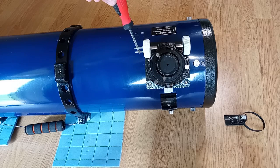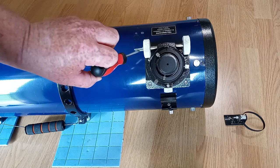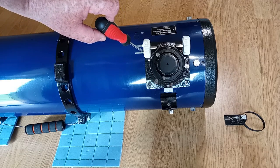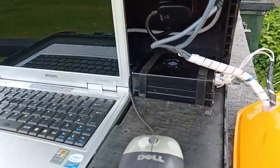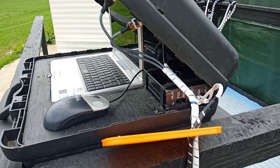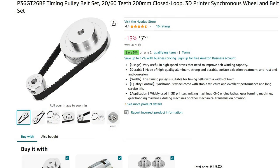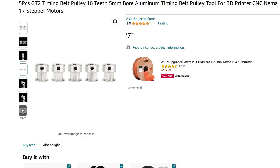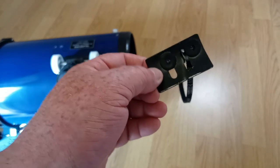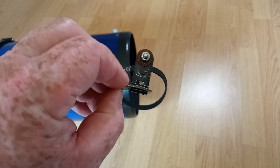A small amount of movement at the top of that screwdriver is a tiny amount at the wheel. I'd done this little mod early on in astronomy, but when I was getting into astrophotography I had a different plan. Because I'd made an OnStep controller, coupled with the software I use, it has the ability to do auto-focusing. So I was going to initially have a motor-driven focuser — I bought the motors, the kit with gears and belts — but it was going to be just too heavy to put on an already heavy scope. So I figured I'd wait for a lighter scope to do that. But then I thought: I've got pulleys and belt, which means I could still gear this down.